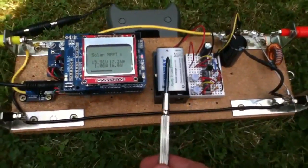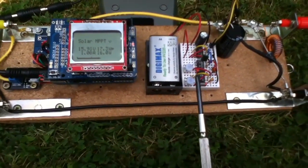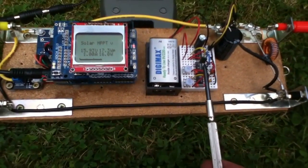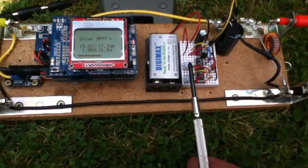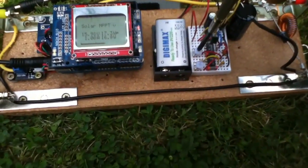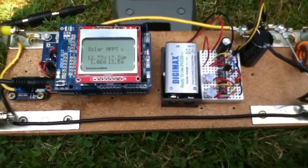Now at this point the computer stops. It's not connected in any way with this section here, which is an oscillator — just a simple 555-based oscillator where I can vary the frequency on this pot, the pulse width on this pot, and I can take the pulse width all the way up to 100%.